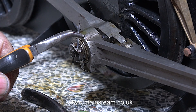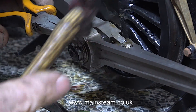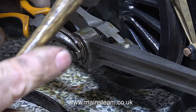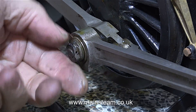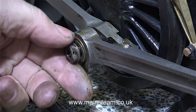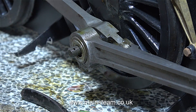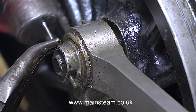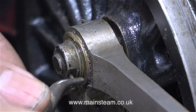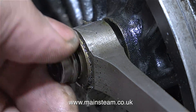Here's a good tip: for driving out very small taper pins, use a panel pin held in a pair of pliers. But when doing any hammering near any part of the engine, never hit the parts too hard and always control the hammer's movement, because if the hammer slips and hits the coupling rod, it's ruined. Here's a close-up of the panel pin principle as I tap out the taper pin that's used to stop these special nuts from working loose when the engine is in service.